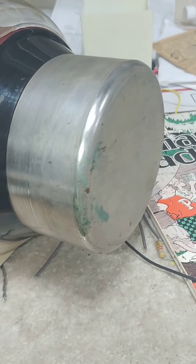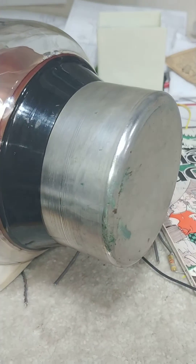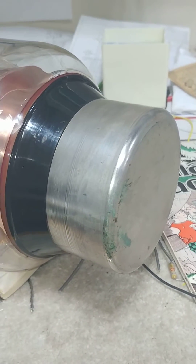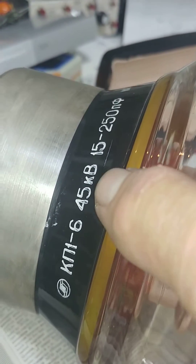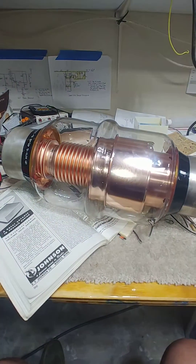On 160 and 80 meters, I'm trying to get it down to 40 meters. So to do that, I'm replacing the capacitor for the one that's in there. This capacitor goes down to 15 picofarads, it's rated at 45 kilovolts, and it's 15 to 250 picofarads. But you've got to take a look at this thing to get a feel for it.